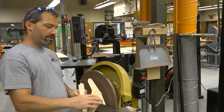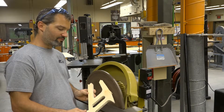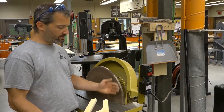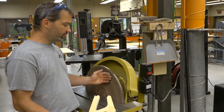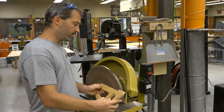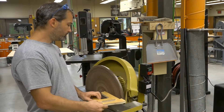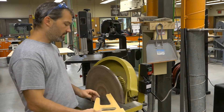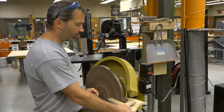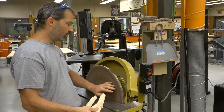I'm going to use the disc sander to get the straight parts as much as I can before I finish out with a file. The problem with the disc sander is it's coming down on a curve. I have it going in reverse right now, so it's going to be coming around this direction. I'm doing that so I can get in on this side as close as I can, and then I can get on that back side as well because it's open back here, whereas on that side I have a break. So I'm going to clean this up as close as I can with the disc sander.